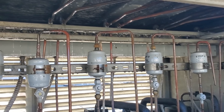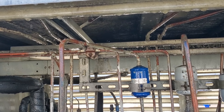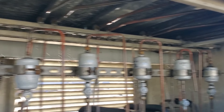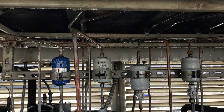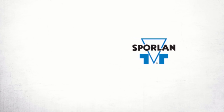Got to point out the biggest flaw in this rack in the world. Remember in the beginning I told you guys that there's a catch pan — that catch pan prevents the water from falling onto all the electrical components of the compressors. You see how it's coming out of this side. All that lint that I washed out is in that catch pan, so when that water evaporates and dries up, all that lint goes right back up onto the condenser.